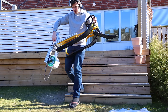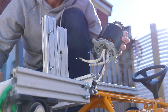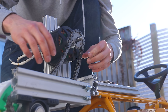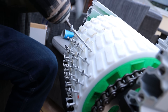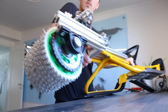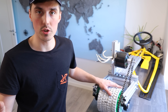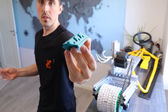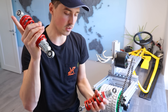It's a little concerning having such a big motor and the chain of death so close to your back. With the drive working surprisingly well, I heated screws and sent them straight into the plastic — heating them so the plastic doesn't crack, which worked really well. 240 studs may seem excessive, but the thinking is to distribute the force across all studs rather than using larger but fewer ones, since the plastic parts may not be as resilient. I also 3D printed a piece to hold acrylic to protect me from the chain. We'll hook up the shock absorbers too — they're overkill, but they look good for the thumbnail.